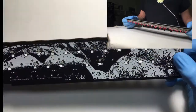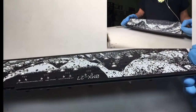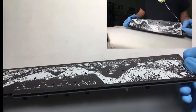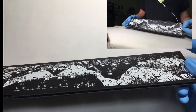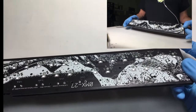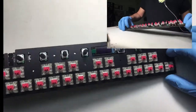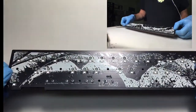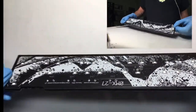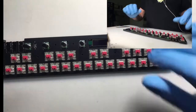But you can flip this over and give it a quick look and see if you've got pins sticking out of all the holes on the bottom, which you should. That's cool. And you're gonna wanna triple check this a couple times to make sure there wasn't a bent pin and one's not underneath before you solder it all together and you end up with, oh, I have a pin missing, what's going on? So give it a quick look on the bottom. Check your pins in each of the slots. I don't know if I have a good way to show that here, but anyway, give it a good look and see what's going on. If it all looks pretty good, leave that for a second.